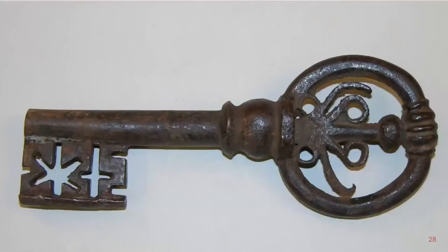The key gives some idea of how complex the wards are inside this lock. You can see from looking at the lock it was hand-forged — the piece of metal was all hammered out, not factory-rolled sheet like the production pieces. It wasn't terribly straight or smooth, but the blacksmith was accomplished. There's extra ornamentation in the bow of this key — a little piece was assembled and tucked into the tube, which would come all the way up through the collar just below the bow ring, with all the ends of the little scrolls welded together and then tucked into the tube when the bow was raised on its notch.